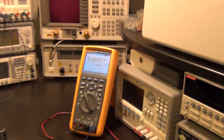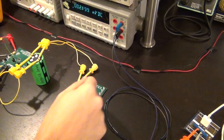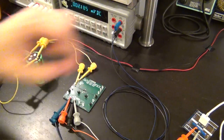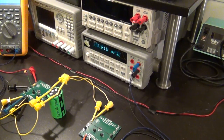If I go ahead and disable the charge, you can see the charging stopped, the voltage went down to zero, and now the voltage on the supercap is going to very, very slowly rise again from the solar panel charging it. You can see it works really nicely. I like these ICs very much - pick up an IC, put it on your PCB and experiment with them. You can experiment with different sizes of inductors depending on the type of source you have. I've put together a complete solution for an emergency cell phone charger using these two boards. Now let's go on to the second evaluation board.